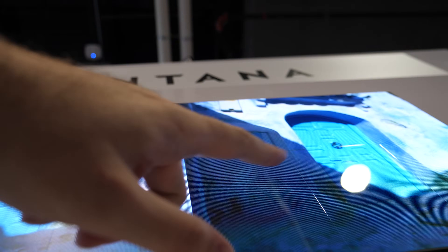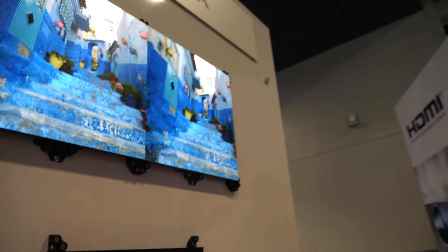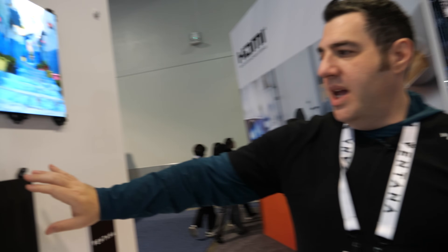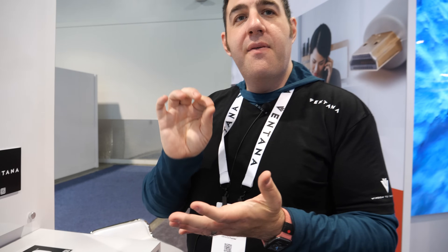There's a visible delimitation because it's two different video sections. The question is whether calibration can get rid of any visual borders. Every individual module — there are six in every single tile — gets individually calibrated for every red, green, and blue of every single pixel. This metadata is stored in memory in the tile, so when they're all connected, they automatically calibrate themselves to know where they are in the array and what colorimetry they're supposed to have.